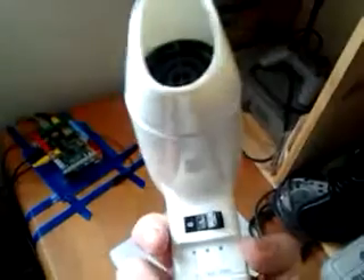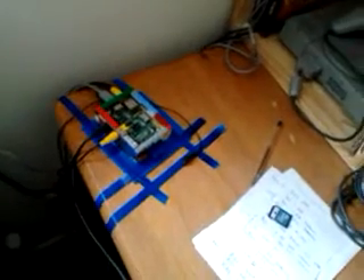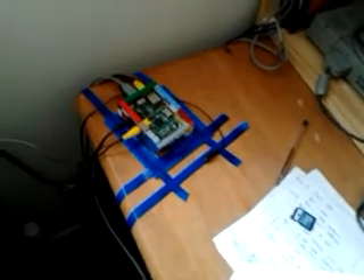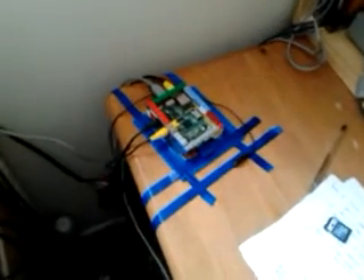What we're going to do is heat it up with a hairdryer — thousand watt — and we're just going to put it on medium heat, roughly about 30 to 40 centimetres away, so it's not to cause any damage. Yesterday we had to leave it plugged in for a good few minutes for the board to be, as I surmise, warm enough for it to boot up.